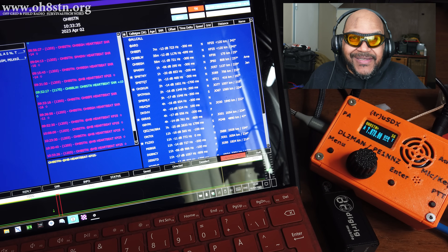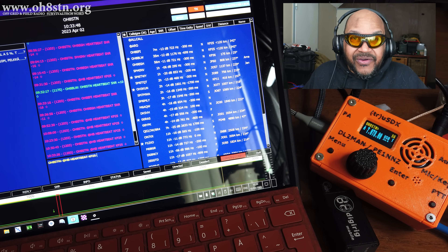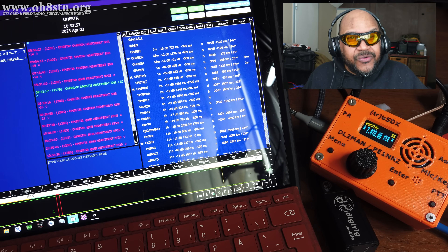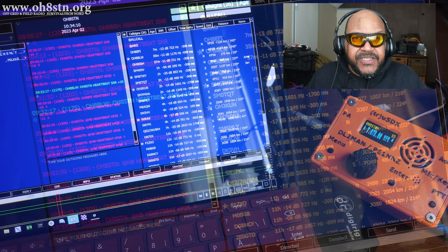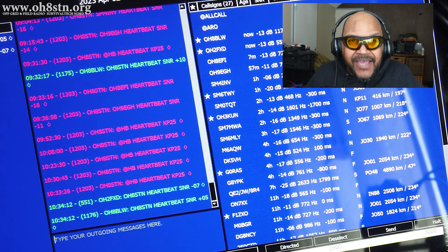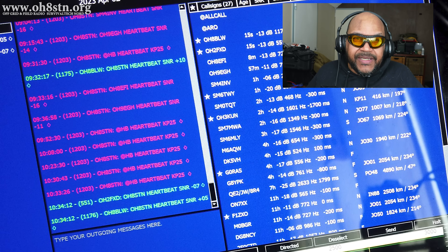I also did some work with JS8 Call. This was actually brilliant because JS8 Call has a slow mode which is extremely narrow and gets your signal out into the world with very little power. Most of my tests were done on 3 watts with the TrueSDX and the DigiRig Mobile. There were two challenges in setting up JS8 Call. The first was figuring out CAT control and push-to-talk — I ended up using OmniRig for CAT control, which worked wonderfully. The second challenge was setting up audio levels in JS8 Call for both incoming and outgoing audio. This is a standard problem when radios don't have a built-in audio interface, made more difficult with an external interface like the DigiRig. But once you get the audio levels set up correctly, it's fire and forget and you never have to worry about them again.